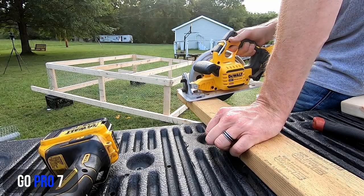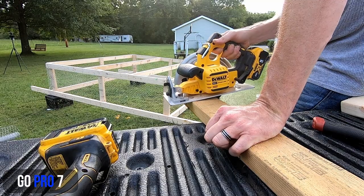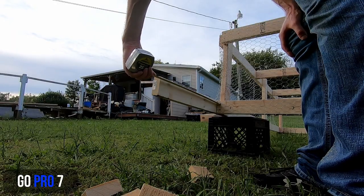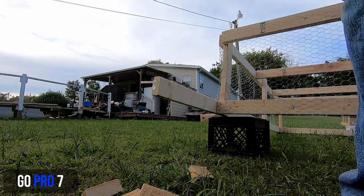When I was measuring those I was adding an eighth of an inch to allow for the saw blade. By the time you get to the end, if you kept measuring the same you'd end up with like a two-inch cut, so always allow a little extra on tight repetitive cuts. It might be a little too much, but just try it. Start your screws like always.